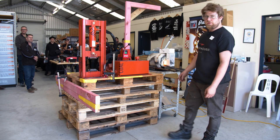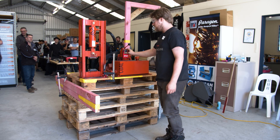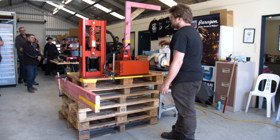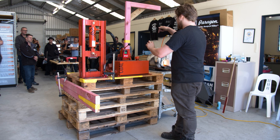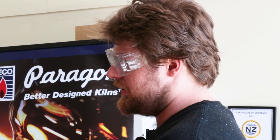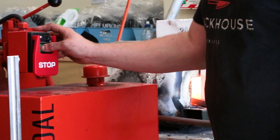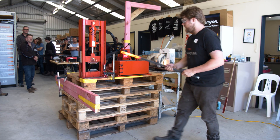This bit of steel is looking pretty hot so I'll start pressing now and doing a bit of a squash. One final thing I forgot to mention - the dies were a little bit uneven when I got them from Coal Ironworks, so I emailed them and they're sending me another set. The way they weld them, welding one side and then the other, the weld must pull it in a bit more on one side, because both dies are slightly open. I've modified and ground them down a bit but they're still not perfect.